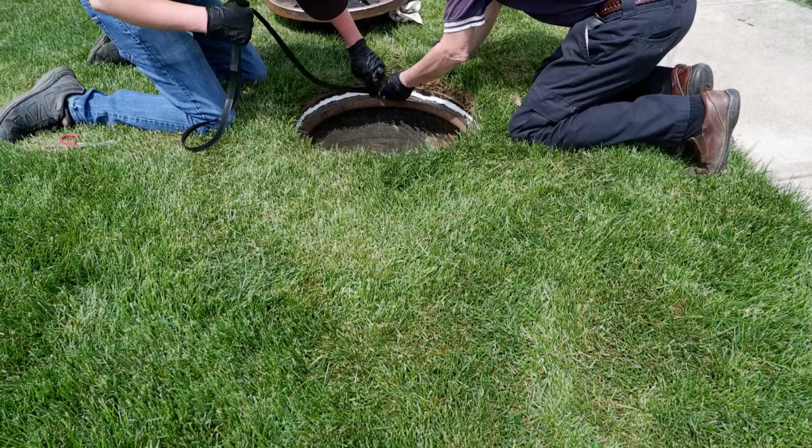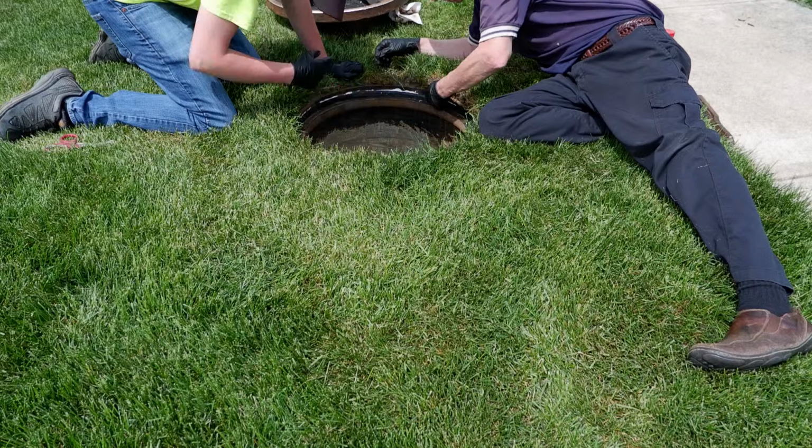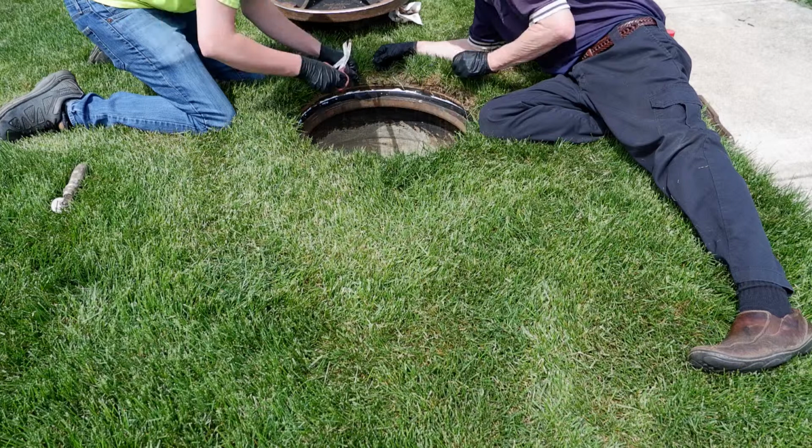Carefully place the rubber seal along the wall of the frame. Once fully placed, use a small roller to work the seal into the adhesive and remove any air bubbles trapped behind the rubber. Cut any excess length of seal and create a butt joint where the two ends meet.